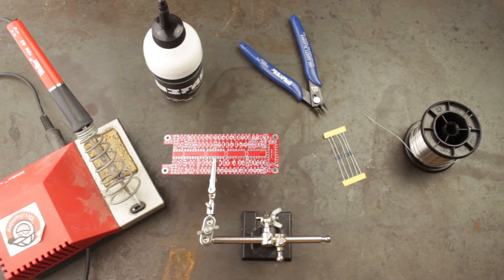To address this first requirement let's look at the soldering iron. Here we have a good quality Weller temperature controlled iron, but any iron between 20 and 40 watts is perfect. If you are using a temperature controlled iron, setting it to around 340 degrees is perfect for leaded solder. You'll also want to use a fine tip of around 1mm.